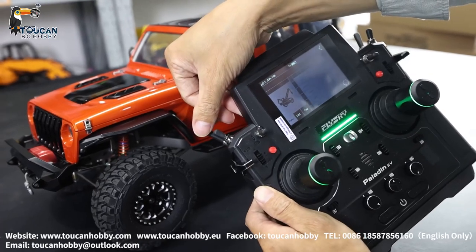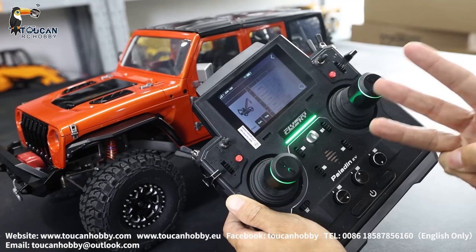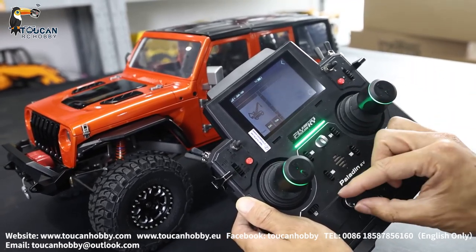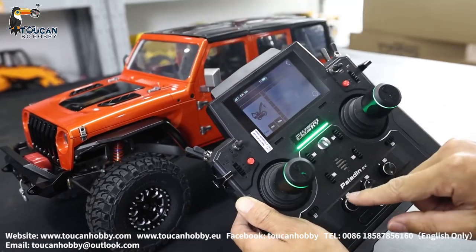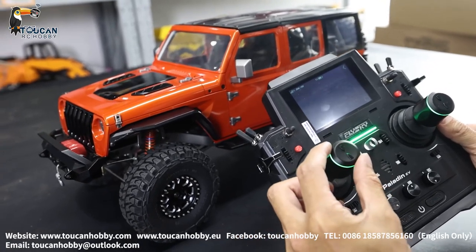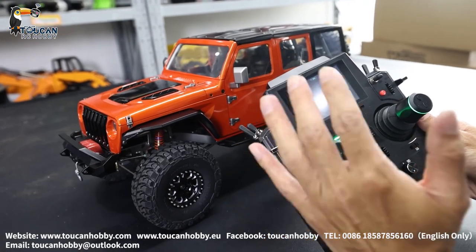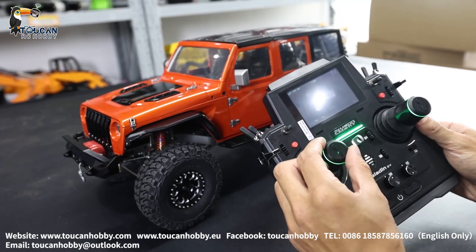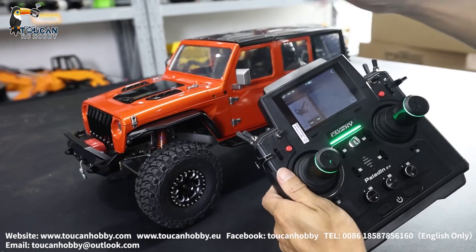Pushing SWF to high speed with VRC at low speed — that's speed 3. VRC also at high speed — that's speed 4. Now keeping at low speed — that's speed 1. Every time you change speed, move slowly, turning a little to let the gear engage. After changing gear, don't start directly. Push a little to let the gear fully engage. That's the main gear SWF.